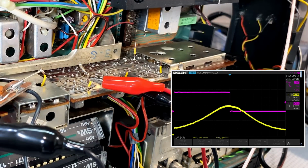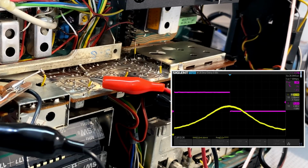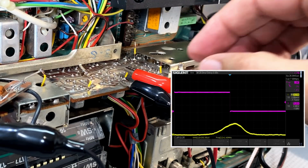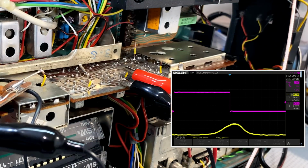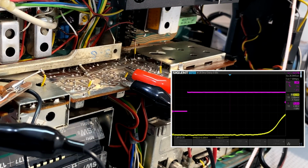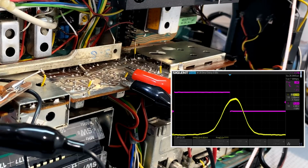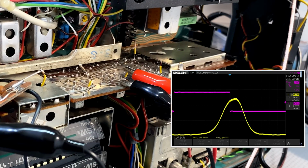I'm going to move back one step. I'm going to decrease the amplitude about tenfold, 50 millivolts, see what happens. Okay, it's there. It's not that strong. Go up. Okay, let me change the span now. From 1 megahertz, I'm going to make it 600 kilohertz.